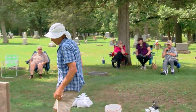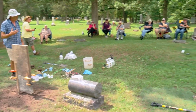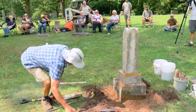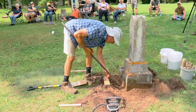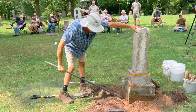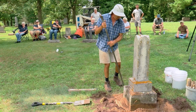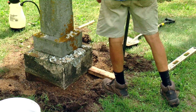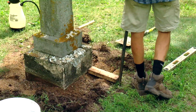I'm gonna walk down here and sight the line. It actually looks really parallel. That's a good thing. So we're probably gonna leave it right where it is. If we wanted to change that angle, we could put the bar back under here. We could pick it up and then turn it like rowing a boat, okay? That's one method. The other method would be to plant this here, low down, and we could push it, okay? And both of those methods will tend to not disturb it from being level much,